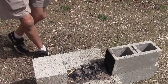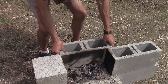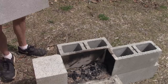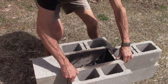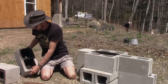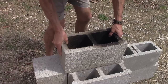Using the six-inch block on the back — which is two inches less than eight — means I can take the side cinder blocks and bring them about an inch in on each side. The side cinder blocks can be sixes or eights, whichever you want. The idea is that they come in and overlap a little right there, and on the other side the same thing. Now it creates a footprint where I can put a full eight-inch cinder block right on the top.